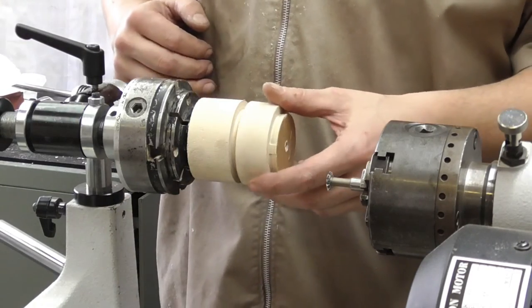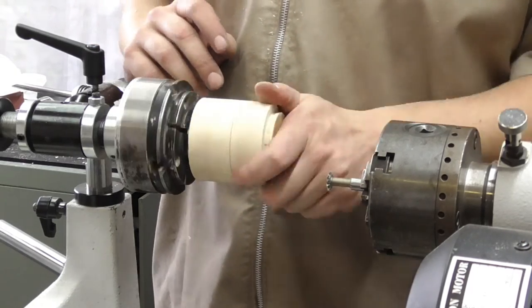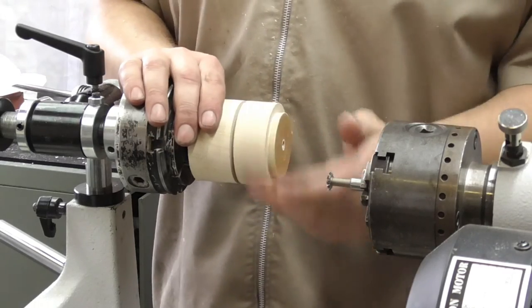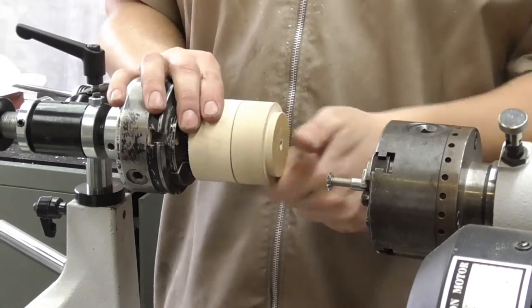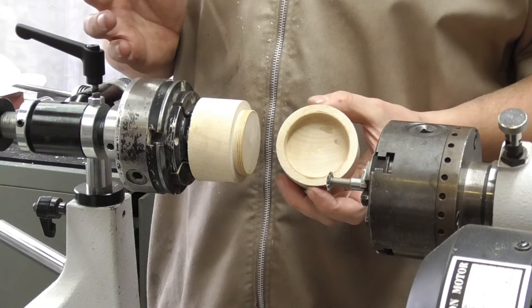Just add a little bit of wax on that. What I like to try and aim for is a loose thread — when you put the wax on you can actually see that it's spinning. And that's what I like to try and aim for. So if you make it to exactly the right offset and do the clicks, this is what you'll be able to produce — a lovely thread.